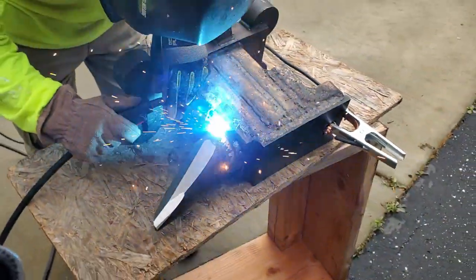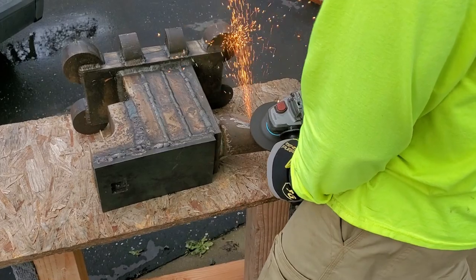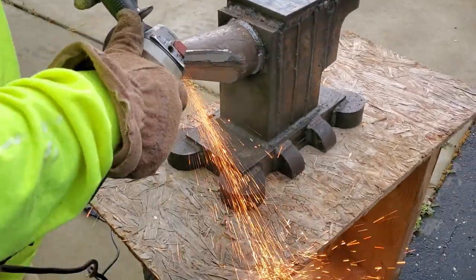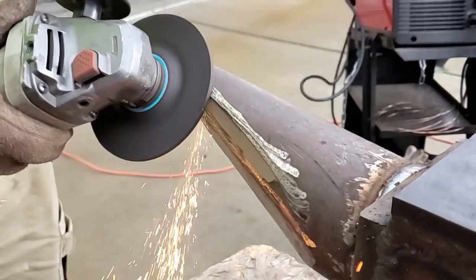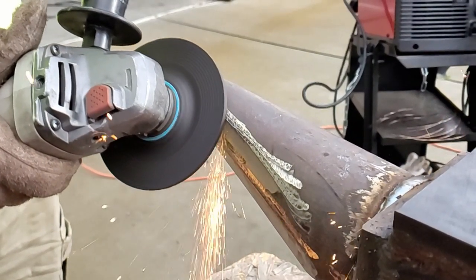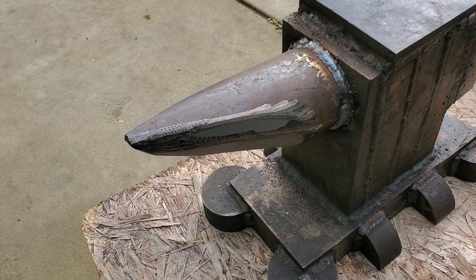This 4140 steel horn is perfect for our purposes. After welding, we began grinding the underside to make it a bit rounder and to knock down the edges, but the steel is so hard the metal doesn't want to be removed. The rest of it will come off later, but she works. We gave it a few light hammer blows and the horn is good to go.